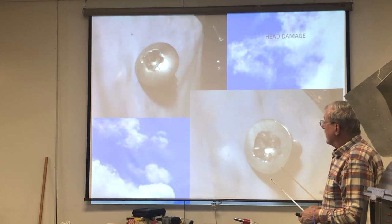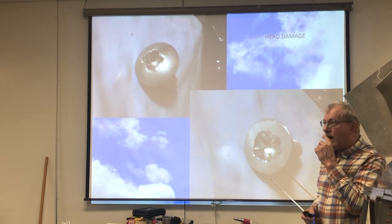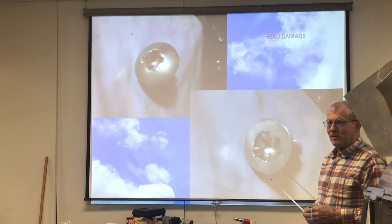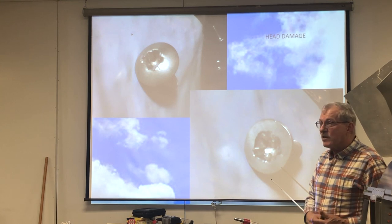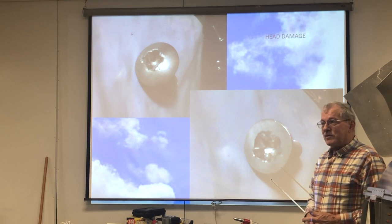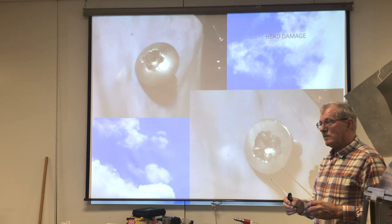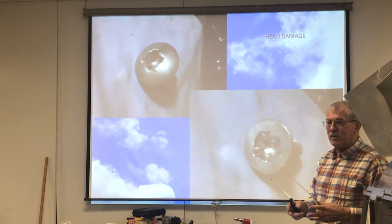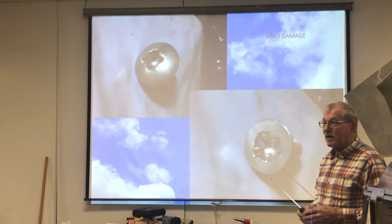Something else about lubricating fasteners when you put them in: I served an apprenticeship for my mechanics license, and when I was learning to work on airplanes, I was taught that if I'm going to put a bolt in, and I have to take it out in 20 years, will I be able to take it out? So I was taught to put a little bit of wheel bearing grease on spar bolts and strut bolts and landing gear bolts, and any kind of thing that would be there for a long time but might not come out.